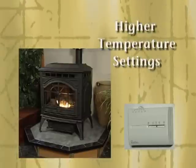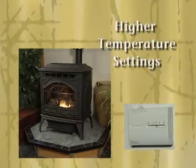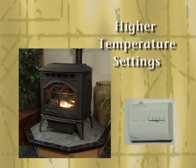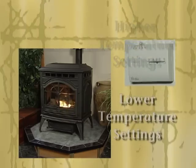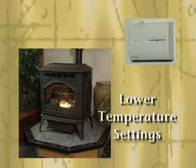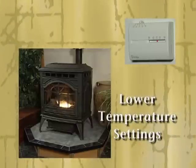Think carefully about where you place the thermostat. When located close to the stove, it may require a slightly higher temperature setting to keep the rest of the house comfortable. If the thermostat is upstairs while the stove is downstairs, you will notice slightly higher temperatures near the stove.